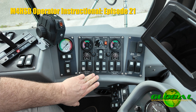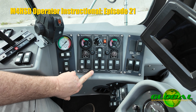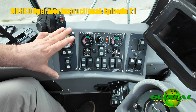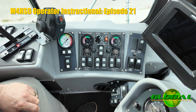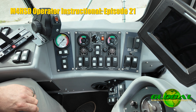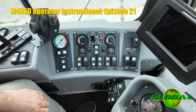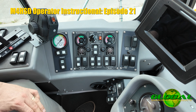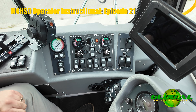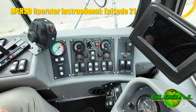Just below that we have two switches. The first is the ergo switch — this is a master sweep switch. When you're sweeping and want to engage all of your gear, turn that on, program everything the way you want it, and you're sweeping. When you're ready to stop sweeping — to reposition the machine or turn around at the end of a road — turn that ergo switch off. All of your functions will shut off and all of your sweep gear will raise and go into a stowed position. When you're ready to resume sweeping, just turn that ergo switch back on. It's one switch on, one switch off for all of your sweep functions.